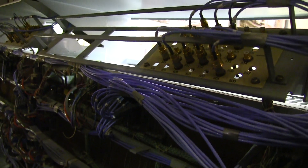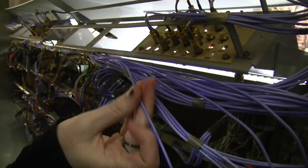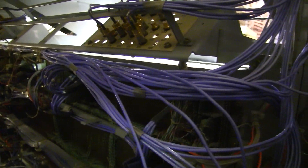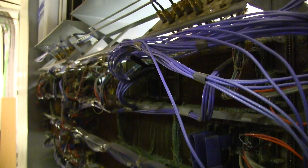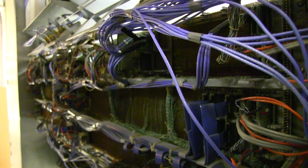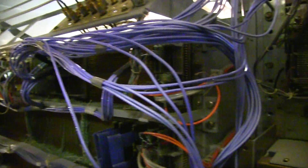One of the most prominent features of this machine is the blue cables that go everywhere. These cables have a twisted pair and a shield, so there are actually three conductors. It's a differential signaling mechanism used to send messages from the processor to various peripheral equipment such as the tape drives. Every communication channel between the processor and a peripheral has six cables: a transmit, receive, and an interrupt request for both processor A and processor B to talk to that peripheral.